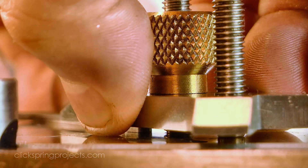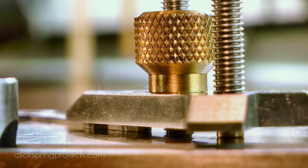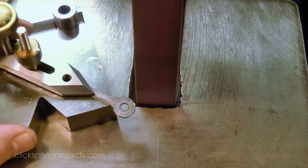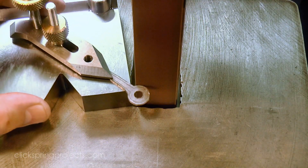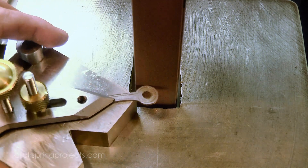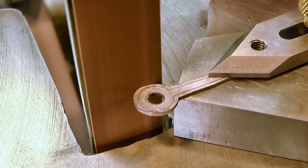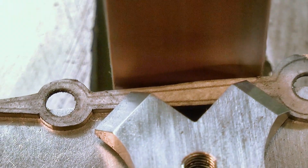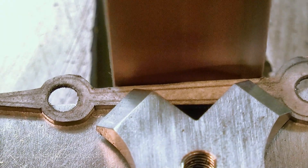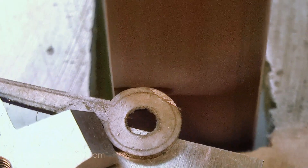The finger plate tool is perfect for safely holding these awkward small parts, and I used the belt sander to bring the edges closer to the line. This 1 inch belt sander is an amazingly effective tool for quickly and accurately removing metal — it's easily one of the most useful machines in my shop. I've left a small amount of metal outside the line so that I can bring the parts to final dimension using needle and escapement files.